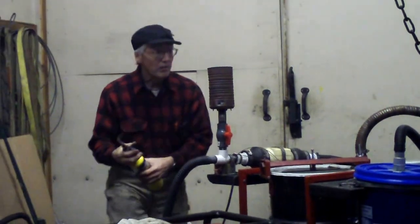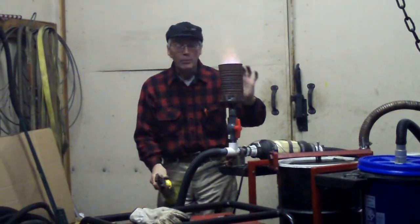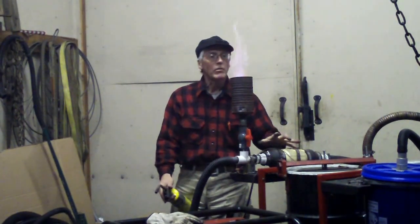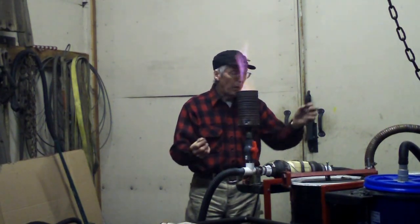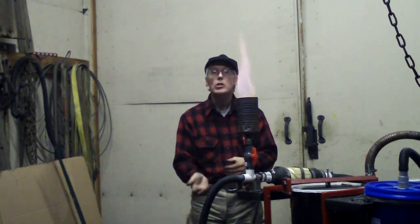It's been running about two minutes. Let's see if the gas is rich enough to flare — yes, it is. I'm going to let it go a little bit longer to evacuate all the stray air and make sure the system is filled with good charcoal gas. You see the nice blue flame? That's very indicative of carbon monoxide burning. This unit also has a fluid drip, so I could drip in motor oil, glycerin, water, or radiator fluid. By dripping that into the hot combustion zone, I'd be adding more hydrogen to this flame, which would add more power to the gas being produced. But I'm just going to run on straight charcoal for now.